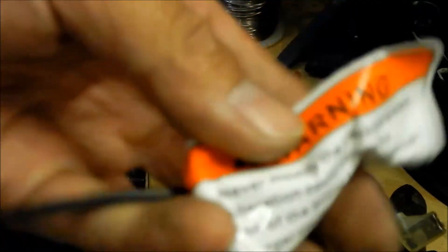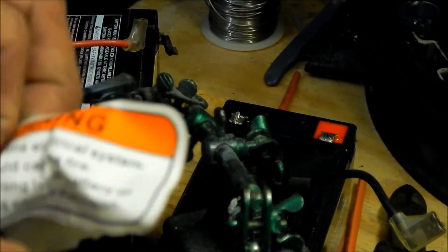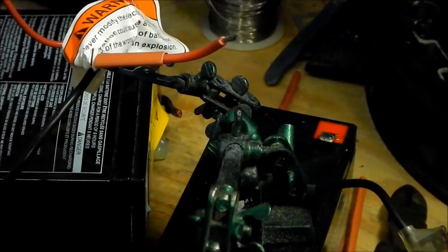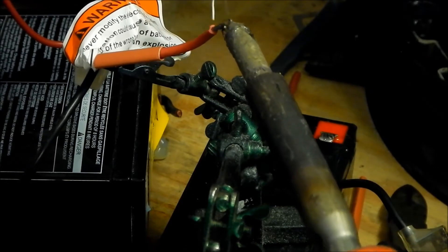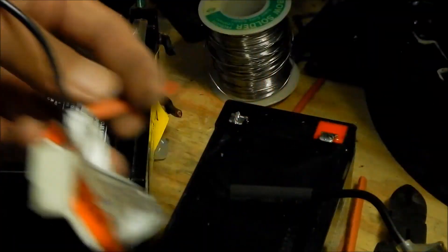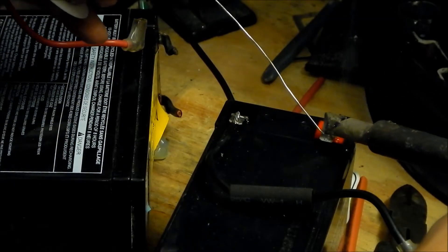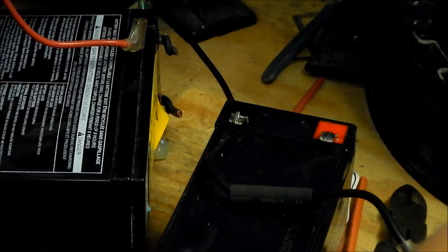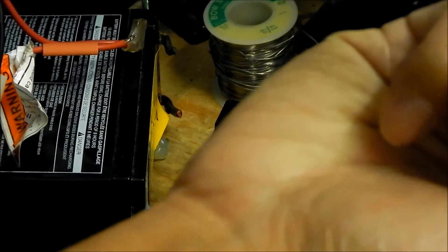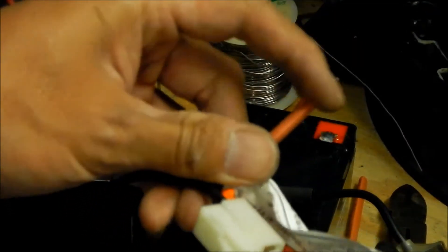Put that over here — it may melt it, so you may have to move it back. Watch the warning sticker. You don't have to strip it too much — maybe like a quarter of an inch. Go ahead and tin that. I'm going to add a little extra tin. This is a very powerful soldering iron — it's an 80-watt soldering iron — so you don't really need a whole lot of flux.